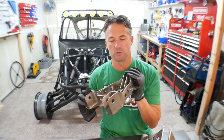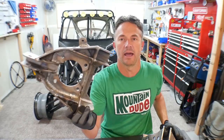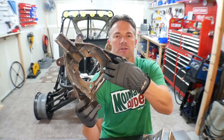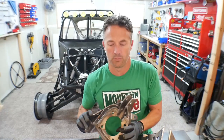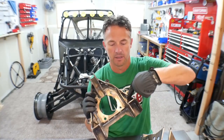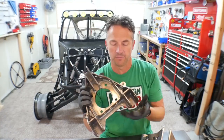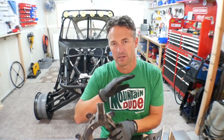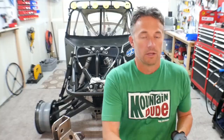The last thing that you saw me doing there was sandblasting, and the reason I do that is this has a lot of little tiny nooks and crannies that I'd never be able to get in there with my chipping hammer or with a brush or anything. So when I'm in a situation like that, I just take my sandblaster and sandblast in some of these areas — it really just blasts it nice and clean, blasts most of the welding debris out of there, and then it's in good shape for some paint.